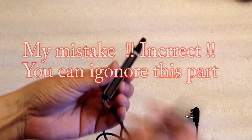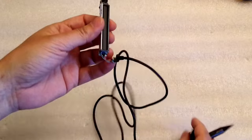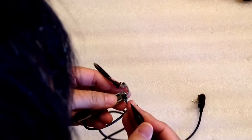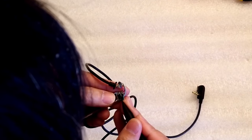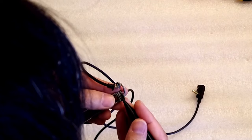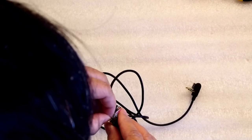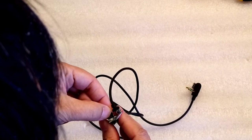So right now, it's not powered up. So the first thing, of course, I would do is to test the continuity of all of these wires to this plug, to see which wire has a problem. But eventually, I think I will have to cut the wire shorter and then resolder it. And there is also a tape on these wires, so it's there for a reason. So when we reassemble it, just remember to put it back. It doesn't have to be the same tape, but you do have to use electric tape and do the same thing.